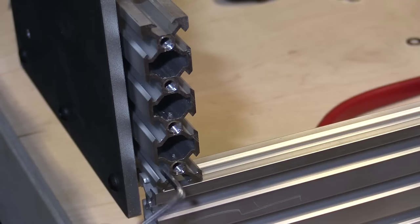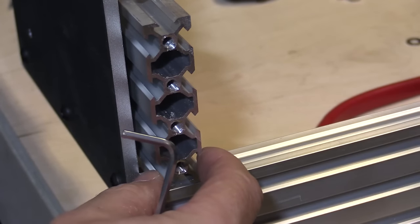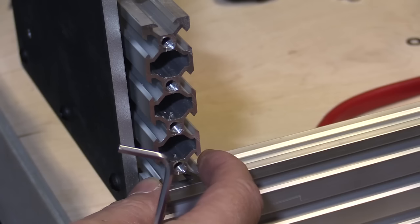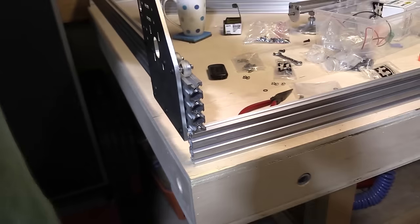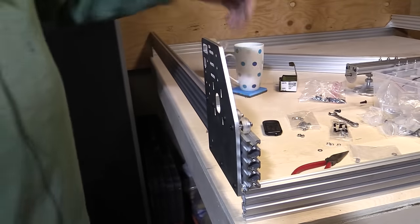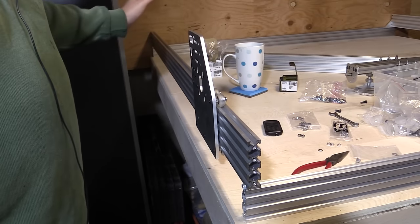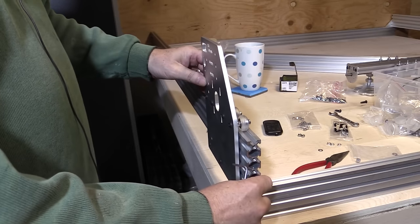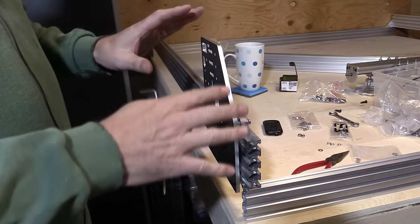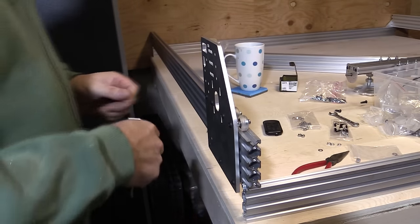What we're going to do is mount the gantry, put the cross rails on, get them all squared up and tighten them down. This will naturally find the right position. Then we'll slacken the back ones off as well and slide the gantry to and fro down its length. With everything on here, when we slide this back, the back 80-20 rail is also going to adjust to its natural position. We just need to make sure we keep everything nice and square so that that happens.